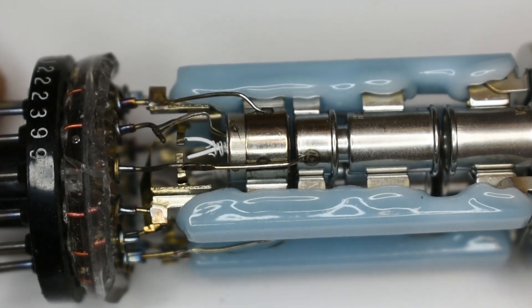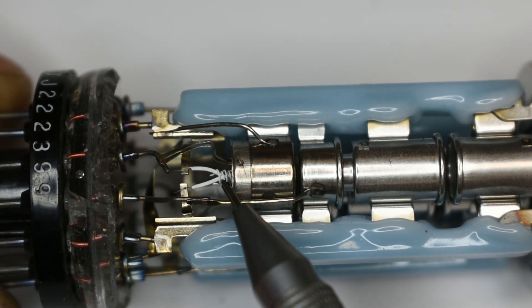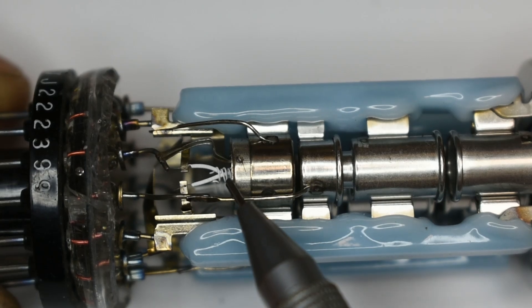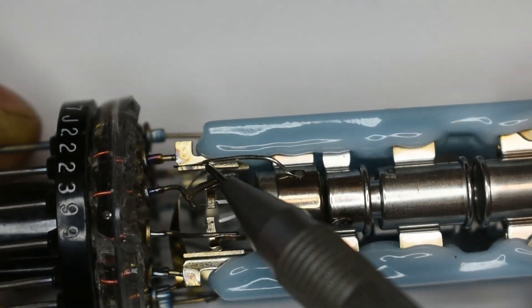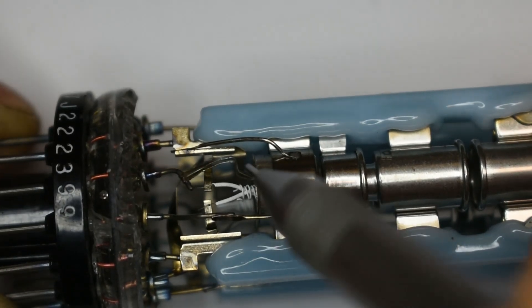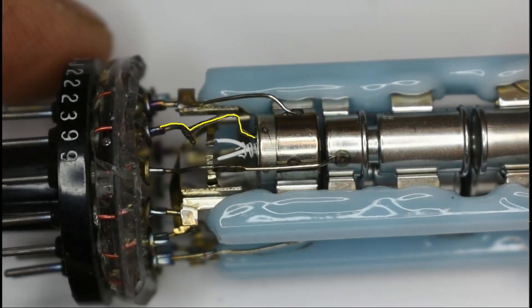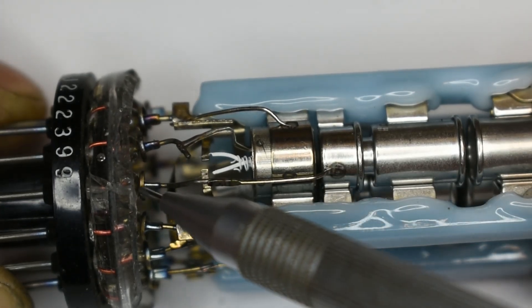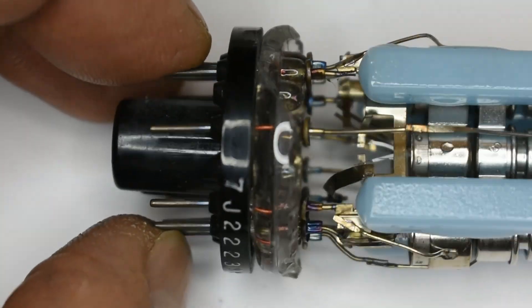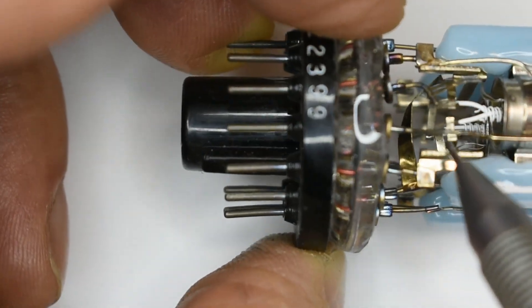This inline gun is large enough that you can actually see the connections inside very well. That is one of the heaters here — the two filaments for the heater — and this goes into the cathode. There's a spiral part which is only the heater, and the cathode is slightly tucked inside the cylinder which is the grid. The cathode connection is this fine wire that goes inside, behind the heaters but inside the grid connection. The first anode and its connection are here. The three heater connections are in parallel and feed out across the key on the socket to all the heaters.